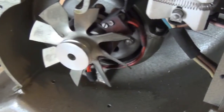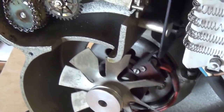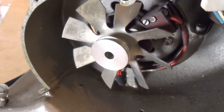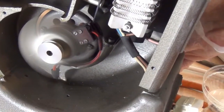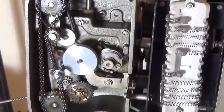The seller said that the fan was turning but the spindles weren't. In fact, the fan was turning at about one revolution per minute — almost nothing. And the spindles appeared not to be turning, but in fact they were creeping along at about one frame a minute. So, clearly there was a problem. Maybe it's jammed up somewhere, so I took the drive belt off, and sure enough, I turned on the motor. The motor's fine. I need to see what's binding the mechanism.